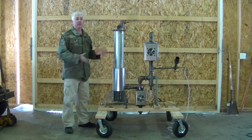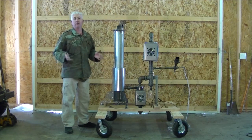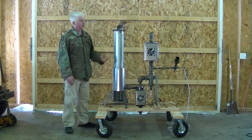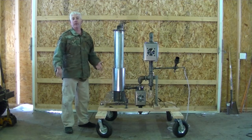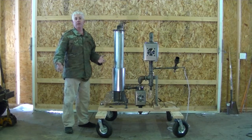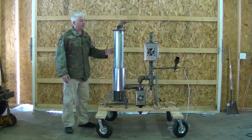All that means is I've taken out the primary cooler. If you have an application like a four kilowatt generator, you've got more than enough cooling with the cyclone cooler and the final filter cooler to cool your gas down. So if I get rid of that primary cooler, it's all good and I can save some people some money. I can take a few hundred bucks off. So let's go through this thing.